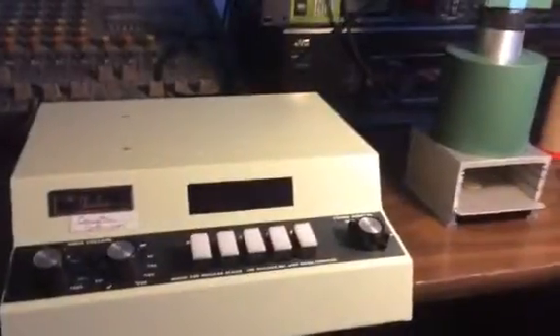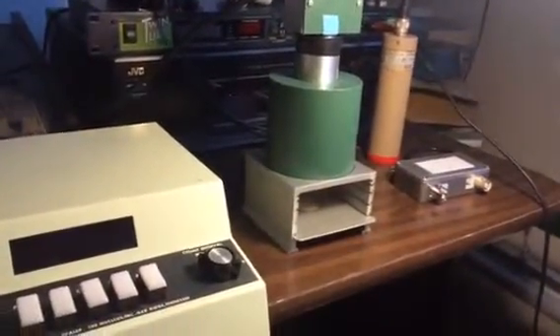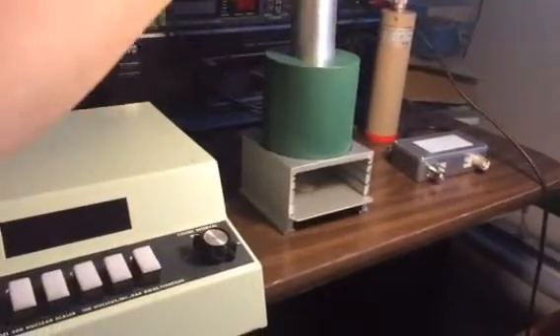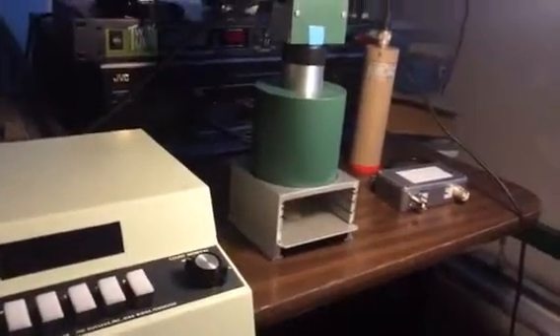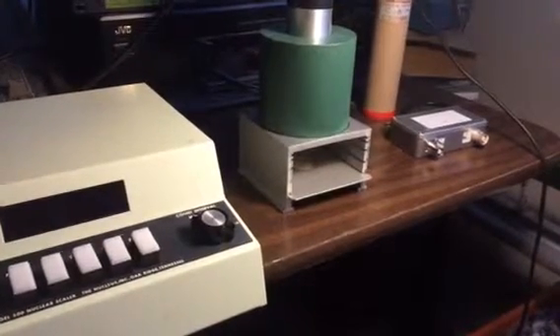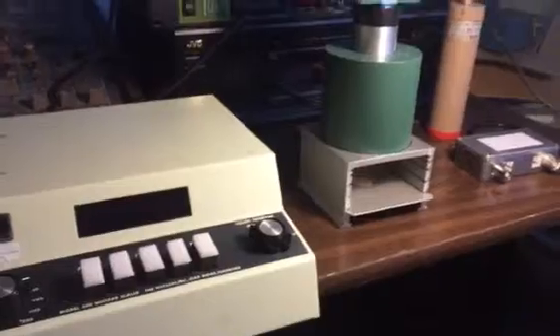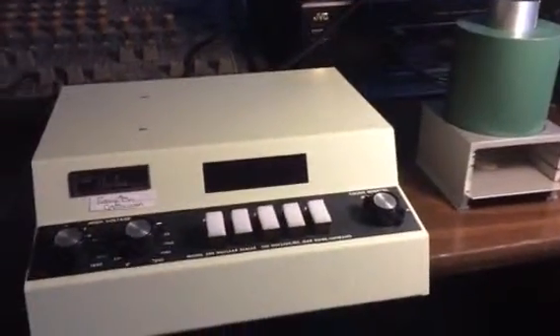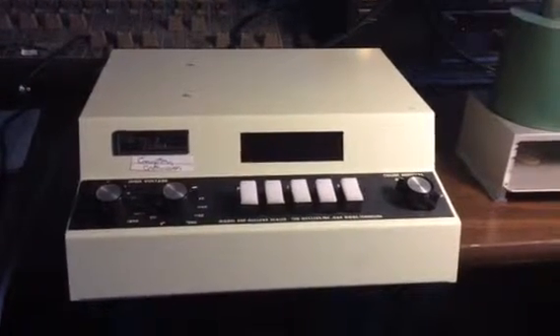For this demonstration, I'm also using the test fixture that comes with the Nucleus 500 counter. It's about an inch and a quarter diameter crystal gamma scintillator probe with a test sample stand. It would work much better with a 2-inch scintillator, but it works pretty well with what comes with the Nucleus 500, and you get pretty good results as you'll see in my next video.